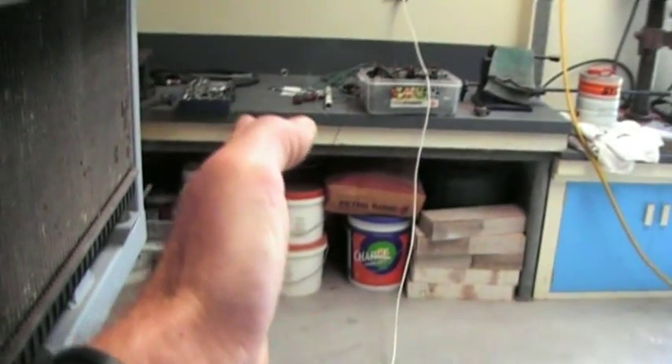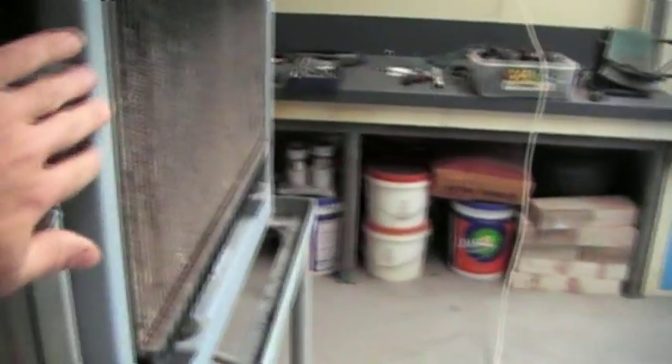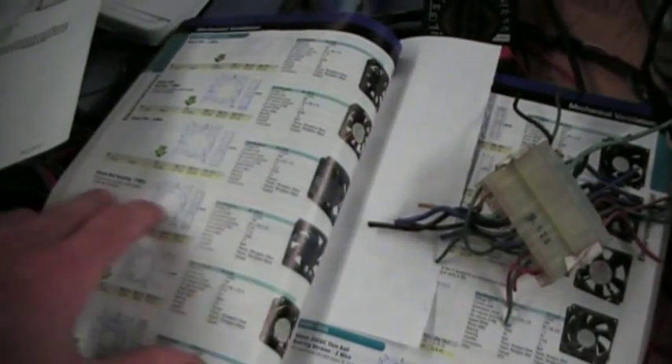So the firewall for compartment C will be here. This will be compartment B, and A is from this point back — this will be sealed along here. So in here I will put those holes in like I said before, but I will actually mount a little block here full of fans, and there is a 50 millimeter 12 volt fan which I will actually mount on top of here. So that should draw everything through this fresh air compartment and just out here, being drawn out by the fans down the back.